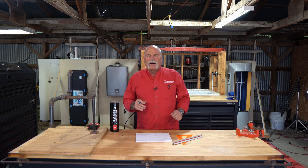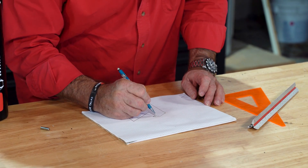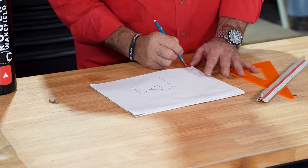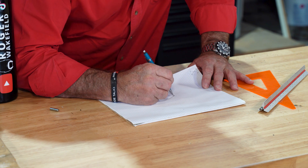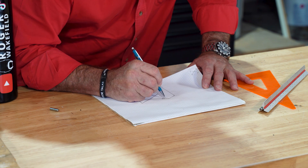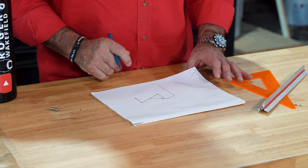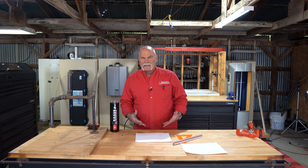Right here I've got a 45, and it comes up and to the west. You'll have to subscribe and come back to the next video — the more advanced one where I do the 45-degree angles. So right now here we are from the southeast point of view. If I were drawing this for screw pipe, I could come in and put all the breaks, and this lets anybody doing a takeoff know that I've got fittings right there. I always draw my fittings and all my breaks in line with the isometric drawings — even a flange down here. I know I've got a ceiling flange on the bottom. So here's my southeast drawing.